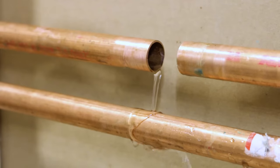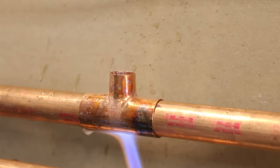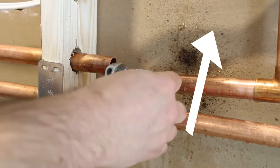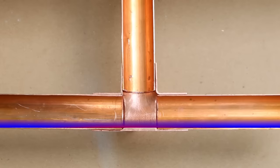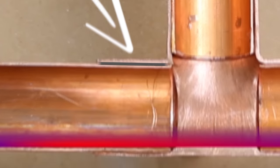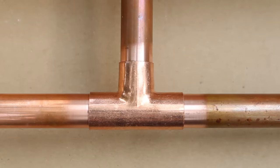Lastly, there's the issue of trying to solder with a bit of water in the pipe. Water is one of soldering's biggest enemies, and I made a thorough video on how to deal with this particular problem — I'll link it in the description box below. The reason you might get a leak is because the standing water at the bottom of the pipe absorbs most of the heat, but not at the top. So the top will melt the solder but won't fill the bottom because it's too cold. Some precautions need to be taken before in order to not run into this issue.